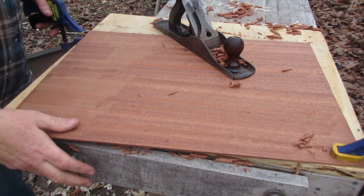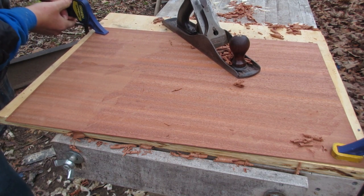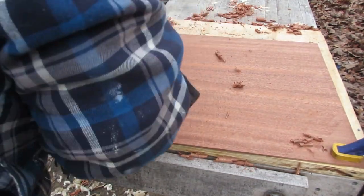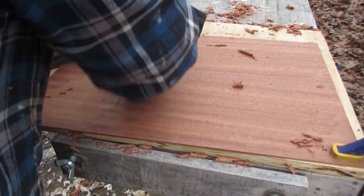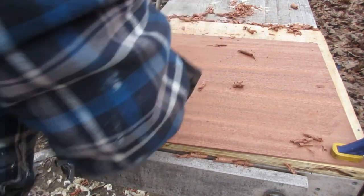That's my philosophy. This top I got between 100 and 110 thousandths thickness; this back I'm thicknessing to right around 110 to 115, and I got in that ballpark. I'm trying to build as light as I can — I don't know if I'll achieve that, but that's what I'm striving toward.